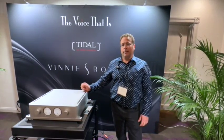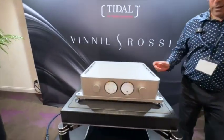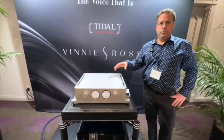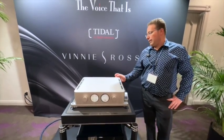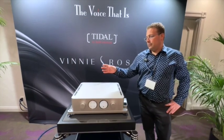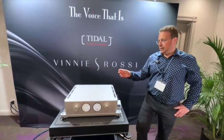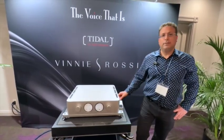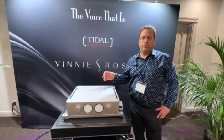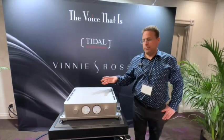What I'm going to talk about is the Brahma pre-amplifier and power amplifiers. The Brahma pre-amplifier is a new dual-mono design featuring balanced in, balanced out, and 300B triodes — one per channel. We're running a 1750 VA power supply that gets continuously monitored, not just for over-voltage but under-voltage, and it also has built-in sensors for temperature.